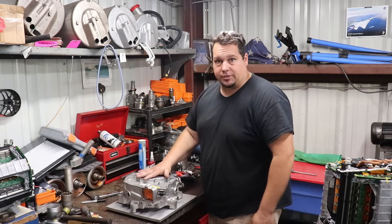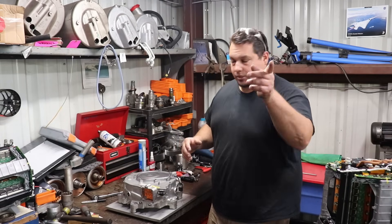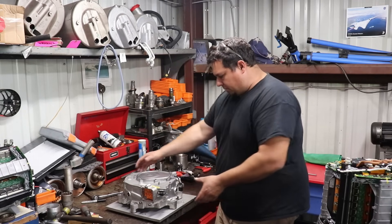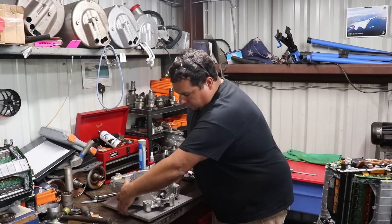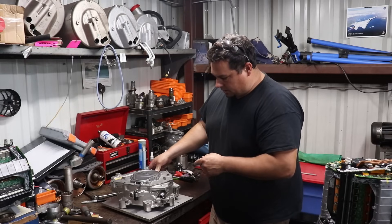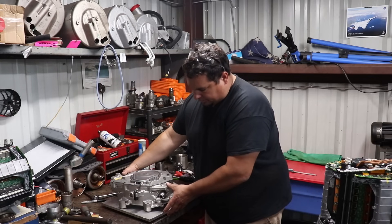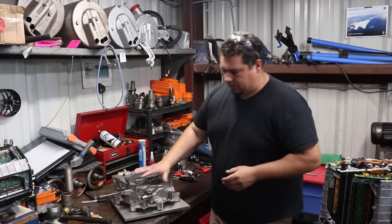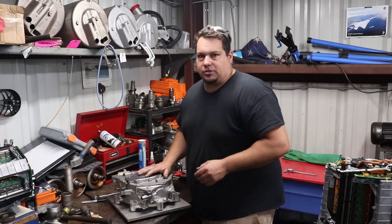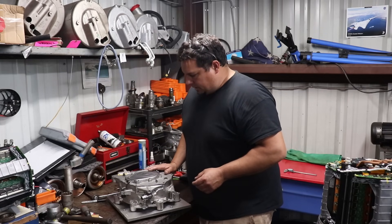From this point I'll line up the plate to where I want it and drill the holes for the generator. I need to be careful about orientation — I'm going to look at how this is oriented in the BMW i3, and also the water line inlets and outlets should probably point up high so all the air can get burped out of the motor. But I won't assume — I'll verify how it was originally oriented first.